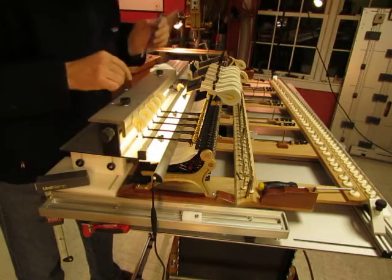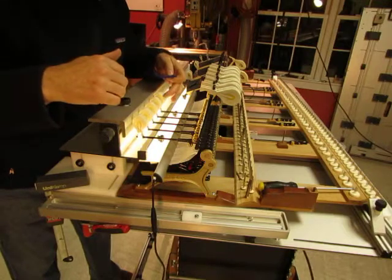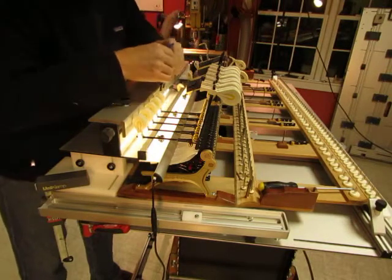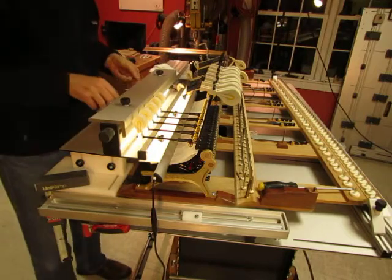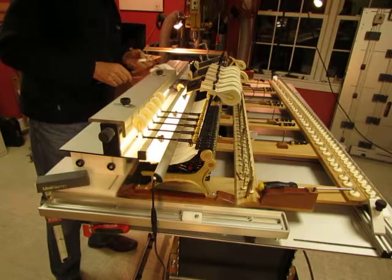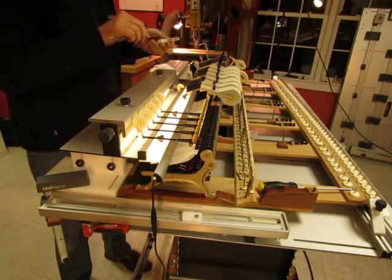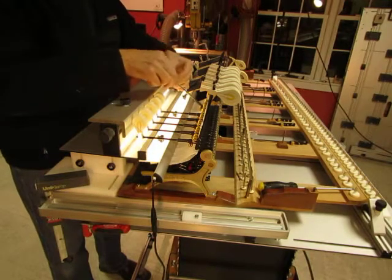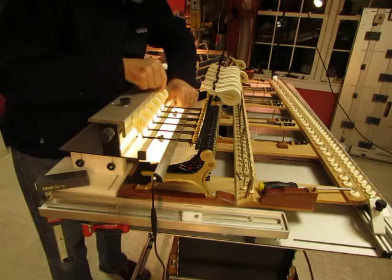The thing about this is I can see all of the hammers that I've hung really well. I can see where their tails are, I can see where their back shoulder is. If I suspect anything about them I can check it out. And I have room to work. It's not impossible but it's less likely that I'm going to get glue on something, or bump into it and change its position, or lose sight of where I am in the squareness of things.